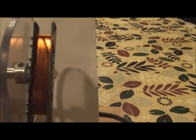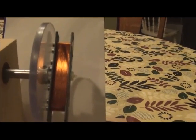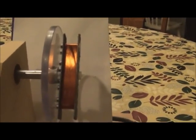There are quite a few things that dictate the tone of a pickup, from the type of wire you're using, the kind of coating, to the shape of the coil, the height and the width of the coil, how tight you wind, how the winding is laying down onto the bobbin itself, as well as the magnets and how hot you magnetize them, and the waxing of the pickup, how much wax goes on, how long it sits in your wax pot. So there's quite a few determining factors to the final outcome of your pickup. A lot of variables. Also the tightness of the winding and how many winds you put on it, of course. Anyways, I'm going to continue on. I'm going to shut the camera off and get these finished up.